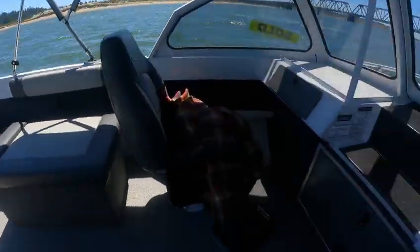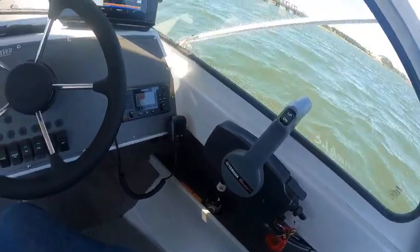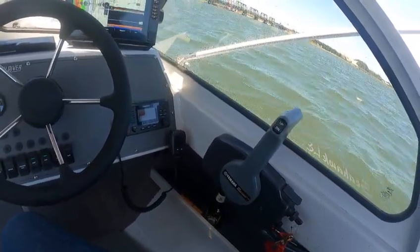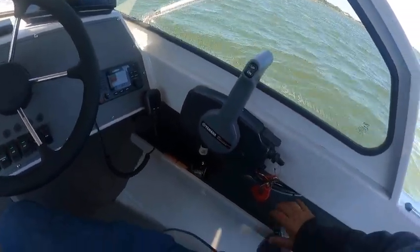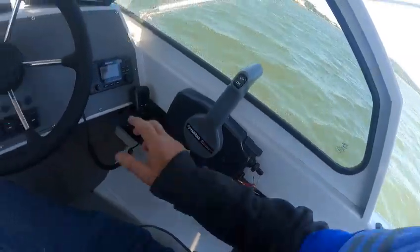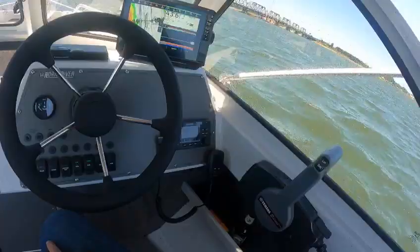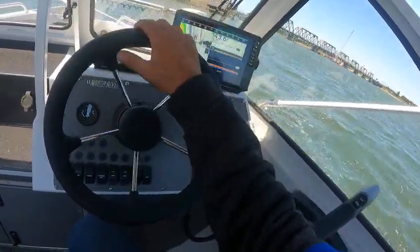Kicker motor I'm working on right now. I'm varying the throttle, say from about 650 up to about 2,500 to 3,000. Then when I get done with that, on the kicker, run it one more hour, no trolling. But you can vary it full throttle from quarter, half, three-quarter, full. Just kind of dink around with it for an hour that way.